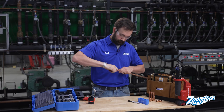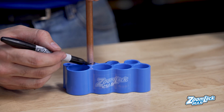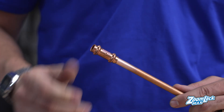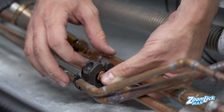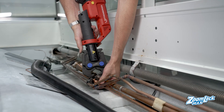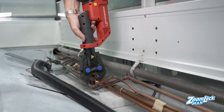Using the Ring Kit is simple. Prep the ZoomLock joint following the standard installation instructions, insert the ZoomLock connector as usual, slide the ZoomLock adapter ring over the connector's crimping area, position the ring inside the ZoomLock press ring jaws, and activate the tool.